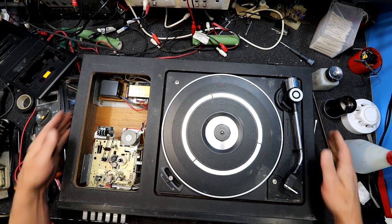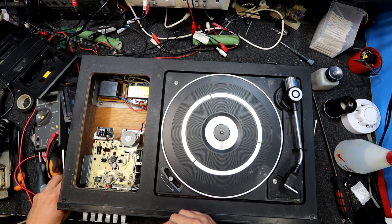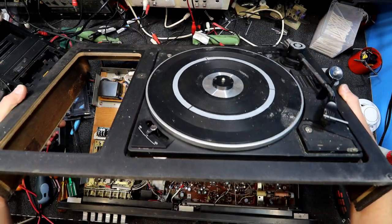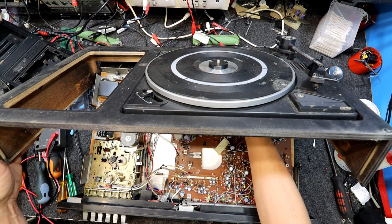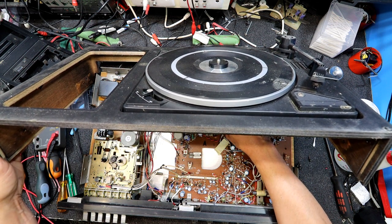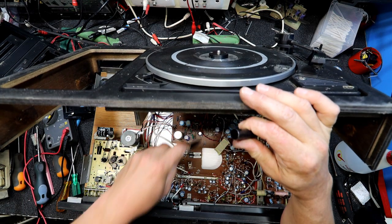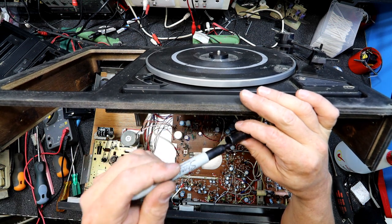So there's our tape mech. This is still kind of stuck in place, even though it's actually stuck to the wood, I think. The metal bracket, yeah, there you go. It's had a bit of moisture on it. Oh god, yeah, rust. It's stuck by rust. And this turntable should unplug. Yeah, that's a bit annoying. We've got two RCAs for the audio, but the power, they've just labelled 38 and 37. 37 is the ground. I'm just going to find a Sharpie and mark one of those with black, and the white wire went to 38.